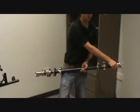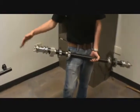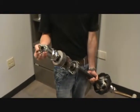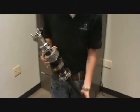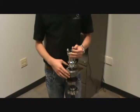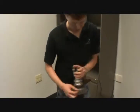The end parts here are the wheel hubs. These actually mount to the rear wheels, and these 3 bolts right here with lock nuts on them will hold the rear wheels on. Next, this cart used a belt drive, but most of the carts we choose use chain drive because it's easier to get a new chain than a new belt in case it breaks on the track.